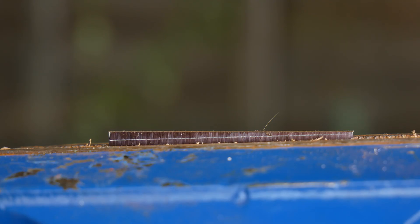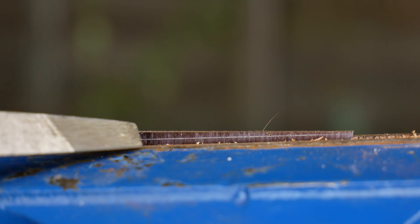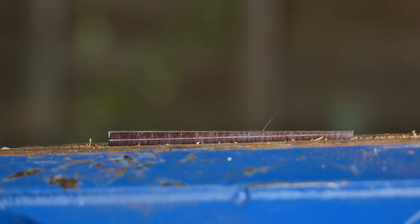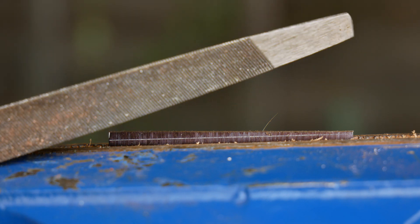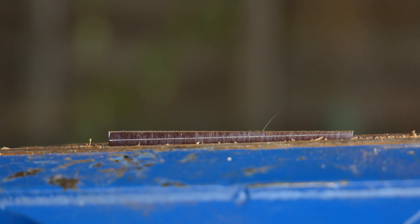We've got everything snugged up in the vice. I've got the bit of metal protected with some leather, which is what those little bits and pieces popping up here are. We've got the line as close as we can get to the vice without giving us the risk of running into the vice and wrecking our file or the top of the vice jaws. Hopefully you guys can see the line. So I've got the first file out here — random crappy file number one — and let's see how close to this line I can get.